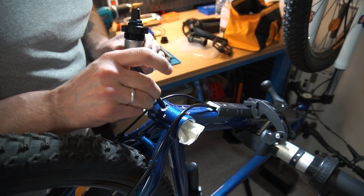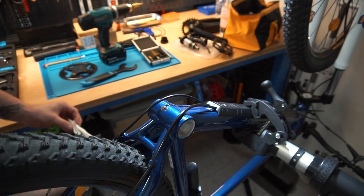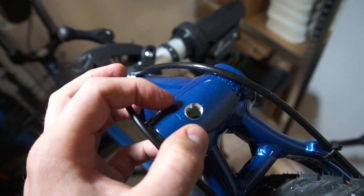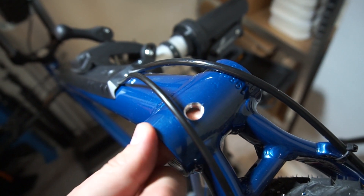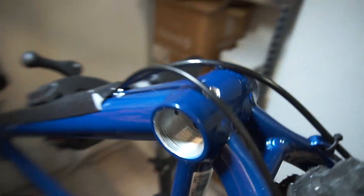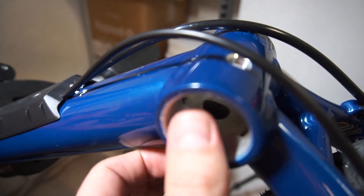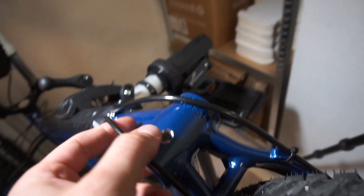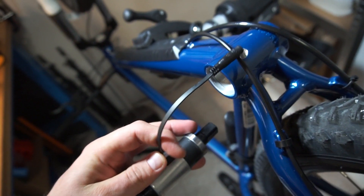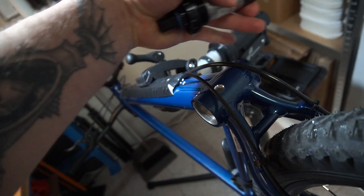Okay, we can try — it fits well. This is what we finally have after drilling. I also cleaned the inner surface, so you can see there are no chips — everything is clean. Now we can mount our torque sensor inside. We first put the wire in the hole, then put the shaft, and then just screw the bearings.